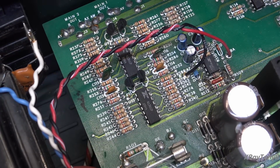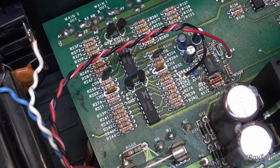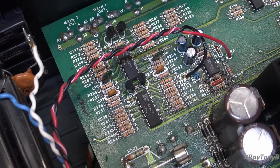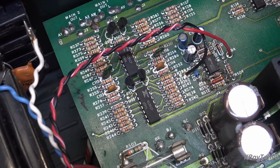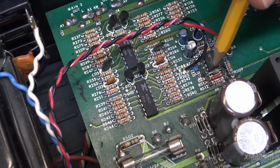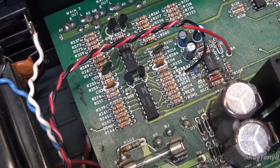And I think one of the other things that these C19s have a propensity to do is that the voltage regulators run really hot on these, and that's why you see this. I put a larger heatsink. I remember this now, I think. And I think these were burned up. And it looks like that's what happened here again, is these traces are just bad.